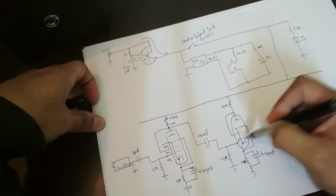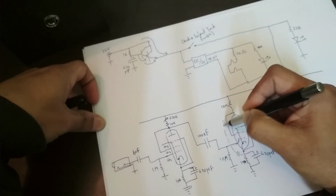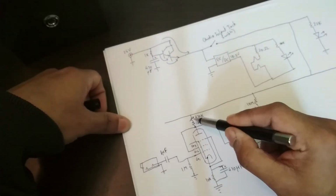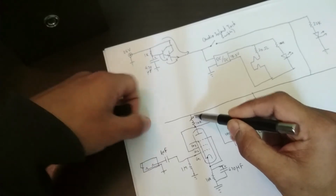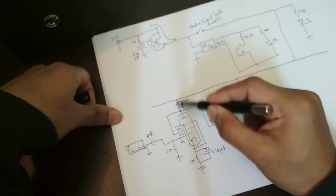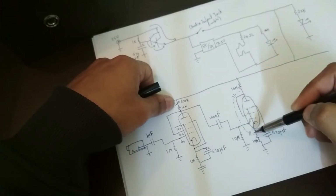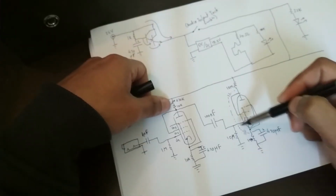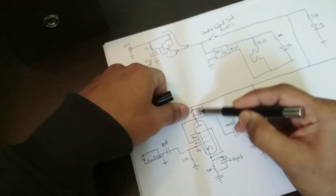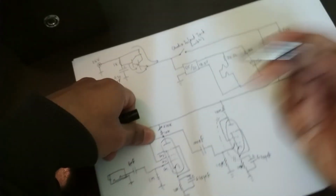The input impedance of this is essentially these little parasitic capacitances that exist, right? And that's the reason that as I turn this up, I like the halfway point best, because you almost get the maximum gain at the halfway point. As you turn that up further, this resistive impedance and this capacitive impedance form a sort of divider, and you start getting attenuation after the halfway point. So perhaps a 200-ish k variable resistor would be a better choice there, but I have 470k and it works fine.